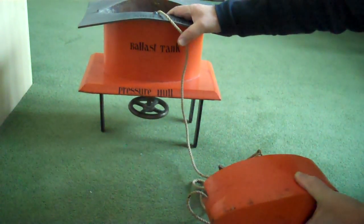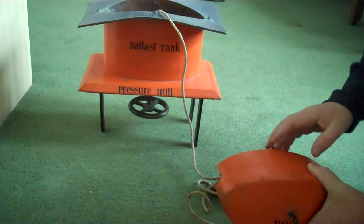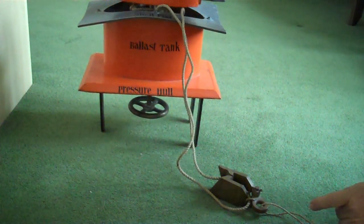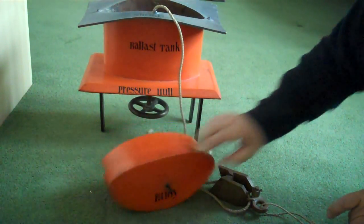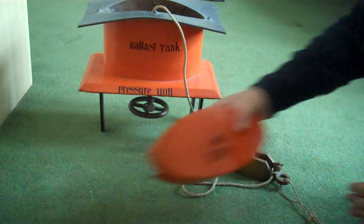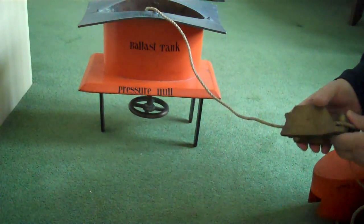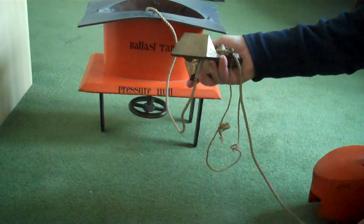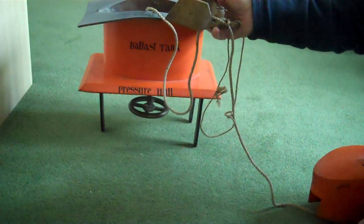This is the plating of the submarine, the external plating. Here is the ballast tank, here's the pressure hull. And a buoy is fitted into this space here, clamped down. In the event of an accident, the buoy floats free. There's a wheel here to release it. On doing so, it carries this messenger line to the surface. And the key part of the thing is this grapnel, which is designed so that it can bite into the inside of this container here from any angle, and I'll show you how it works.